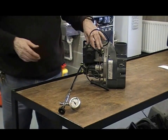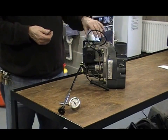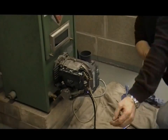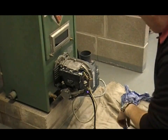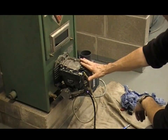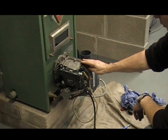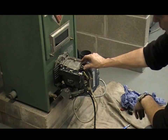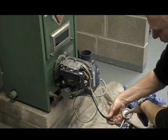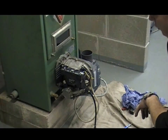So we're going to take it further now. We'll set it up in one of the boilers and have a look at what's happening, then look at the diagnostics and see if we can figure out the problem. Now we have the burner set up with the oil and electricity connected and we're getting a shot of flame just starting and stopping straight away. I'm thinking the problem is the solenoid. We have a pressure gauge but we're not getting pressure on it because the solenoid's not lifting long enough. We'll try and change the solenoid and see if that changes things.